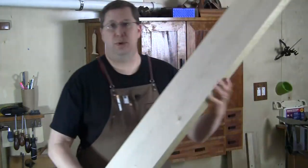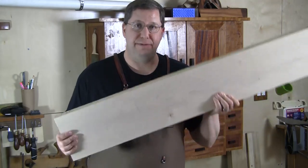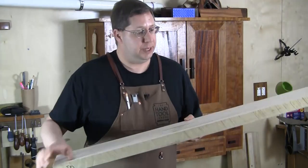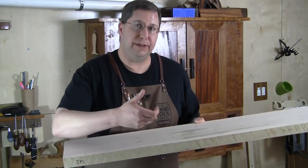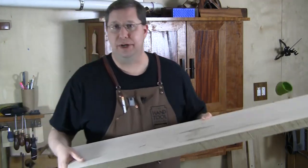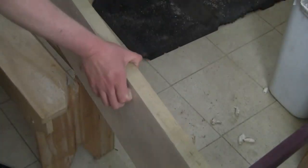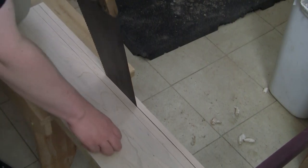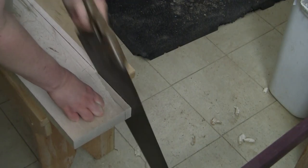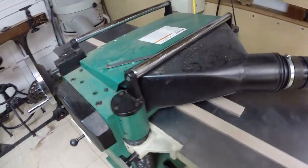I have this piece of 8-quarter maple left over from the board I originally cut the legs out of — it was an 8-foot board and this is what remained after running it through the planer to about 1 and 3/4 inches thick. What I can do is rip off some half-inch wide strips, rotate those 90 degrees, and with a little planing I'll have my 3/8 by 1.5 inch strips without wasting a bunch of leftover stock. I mark my line all the way around the board and flip it, sawing from both faces to check my alignment — I do this about every 12 inches during the cut so I can correct any misalignment before it gets out of control. I also tend to flip to the other end to finish my cut so I'm not working on a really skinny end on the saw bench.